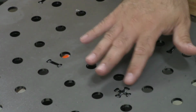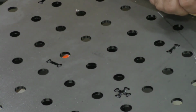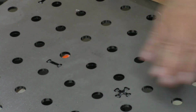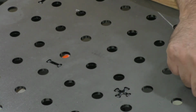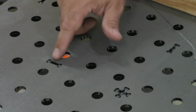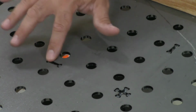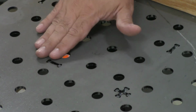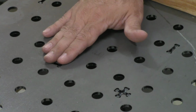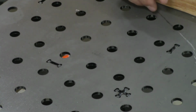You can see they've got laser cut slots. As the name of the company, Tab and Slot, might suggest, the ribs underneath have tabs and the tops have slots. So you can see how it comes through the top, and we can weld directly to there. It's cut out so that I should be able to weld in there with minimal buildup on top, maybe a little bit of grinding to make it smooth, but it should hold it together very well, and it appears to be well designed.